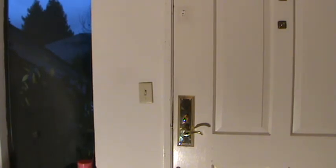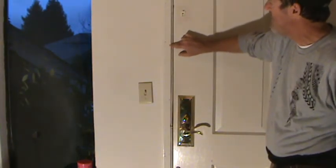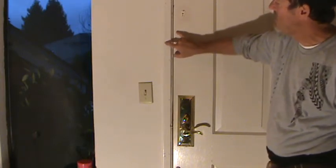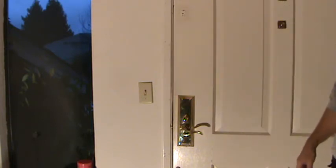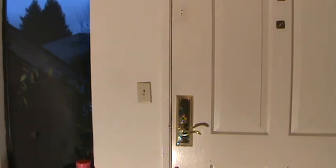When you're on a hill, that's just the type of thing that happens. The reveal turned out really nice — it doesn't look like I did anything, and that's my goal. I attached this with four-penny finish nails on the inside edge because you don't have much wood from there to the door jamb. On the outside you can use six-penny or eight-penny because you have to go through thicker wood plus the half-inch sheetrock before hitting the stud. I'll set those nails and caulk them too. No paint — just white caulking on the cracks.